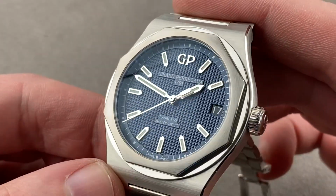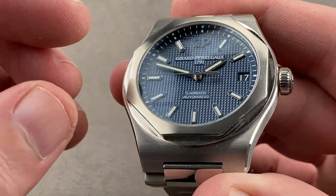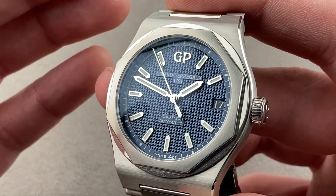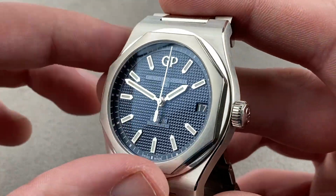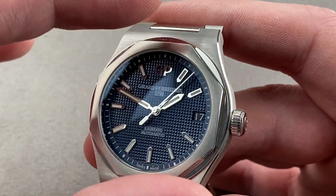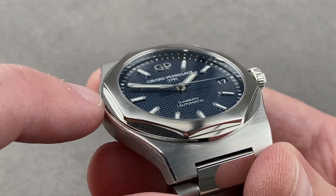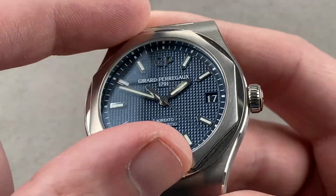And then one of the most interesting bezels in this class. It's not unusual to have a multifaceted polygonal bezel on a watch like this. You can see this one's unusual because it's a physical fixture maintaining the water resistance of the case. It actually screws in. It is the front of the case, whereas, for example, on the Royal Oak, the component is held down by bolts, and then there's a separate seal underneath. This threads into the case the way a case back threads into a Rolex. So it's a threaded component that actually threads into the case and works as a plug to keep everything hermetically sealed on the front. You can also see that it's got a lovely combination of a round polished plinth beneath it, and then it's got that contrasting polygonal form on top with both satin finish and polish.